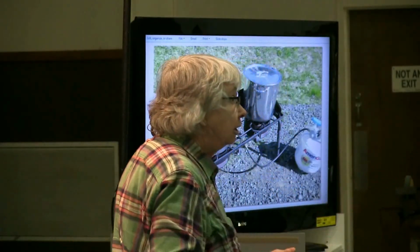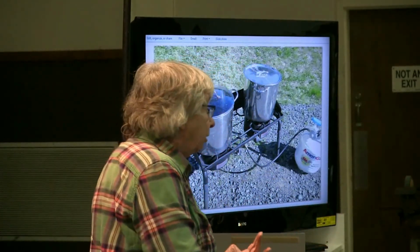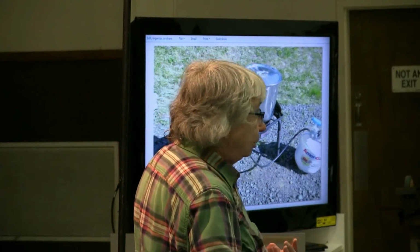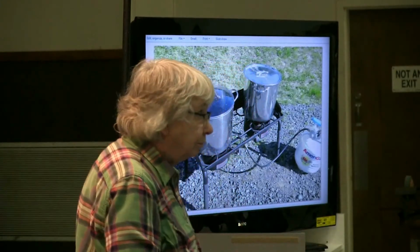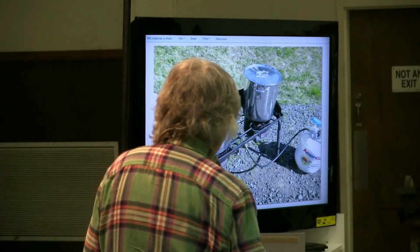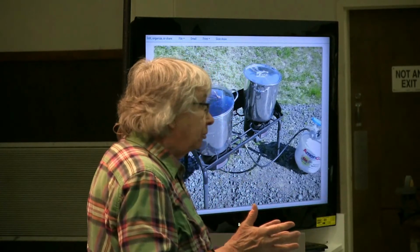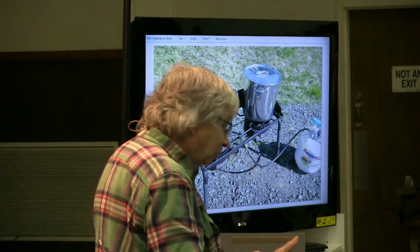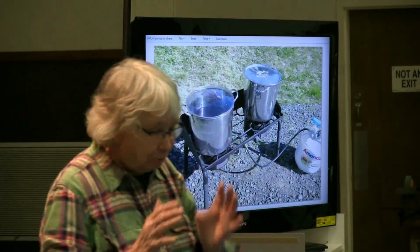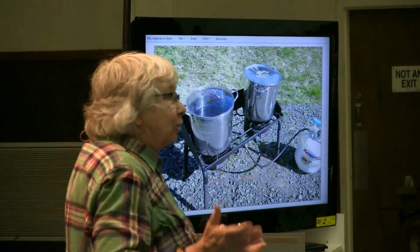The dye pots. I dye my own veneer. I use an aniline dye. I buy it from a company in New York called Lockwood. And I've used the same dye for all four decades. And then I make copious notes, and it's always with distilled water and copious notes, and sometimes under pressure, and sometimes just in atmosphere, and it doesn't matter.